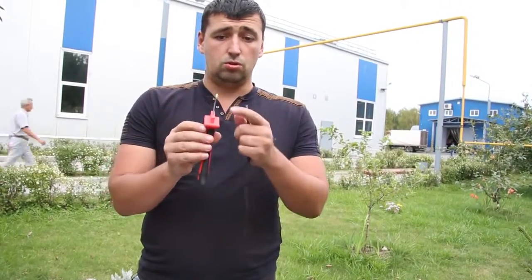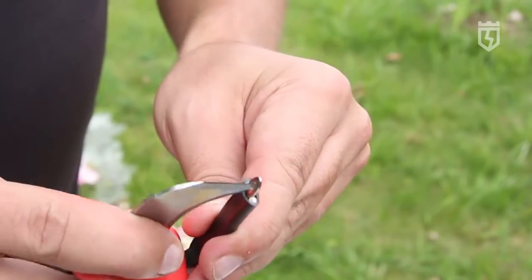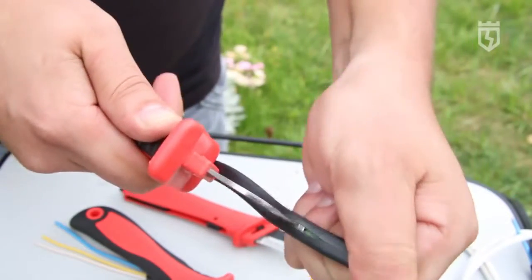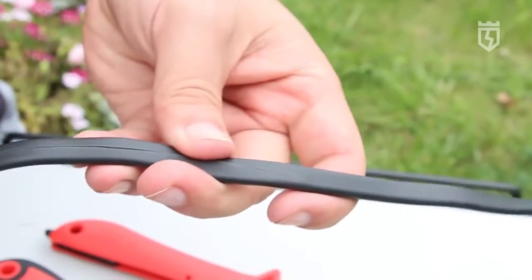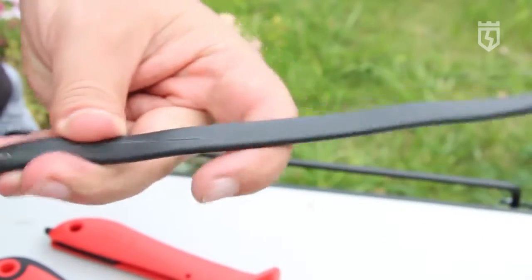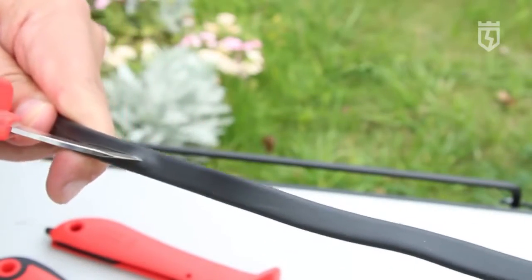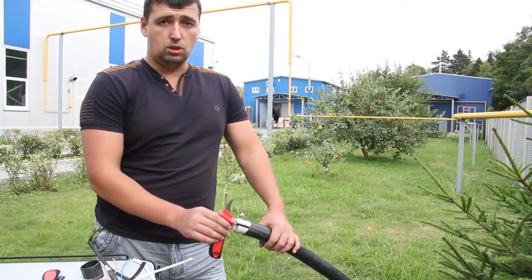This is how it is done — this is the edge technique. With the edge, we pull the blade along the edge. After this, we take it off and remove the insulation. Also, this knife can be used with the back of the blade for opening the cable lid, like this — we can use the back of the blade to open the lid.